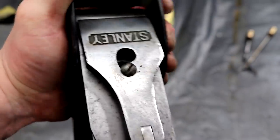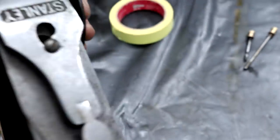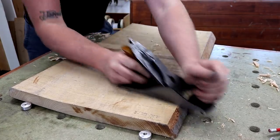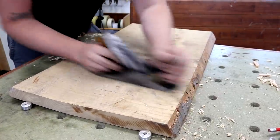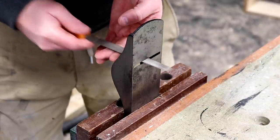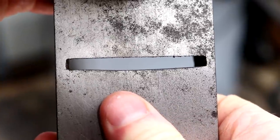At first the depth adjuster was too tight for my liking, so I backed it off because I like to be able to twist it with one finger. Then I can add the front knob. When I first tried it out it worked okay, but I found that I wasn't able to take shavings as big as I'd hoped. So I ended up doing one more modification, which was just to open up the mouth of the plane a little bit to help it cut bigger shavings. I did that with a file and didn't take much material off — maybe about one millimetre from the middle of the mouth — to camber it slightly, similar to the cutting edge.